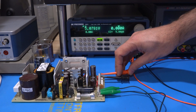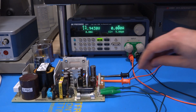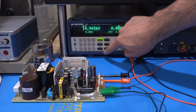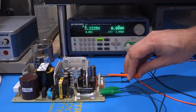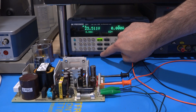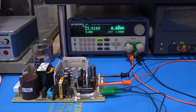The next output should be 15 volts — there's 15 volts. This one cannot supply as much current, so we'll try 3 amps instead. No problem — 43 watts. Again there's going to be some drop, but it looks good. And finally, we have plus 24 volts at the very end. We'll test this too, even though it's really not going to be important in this case. 23 watts being delivered into the DC load. So the power supply works.